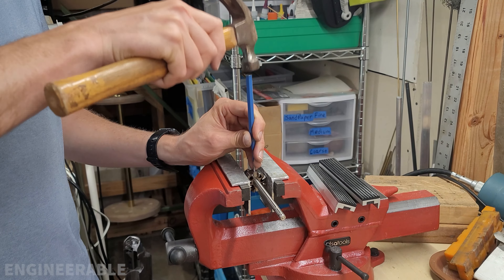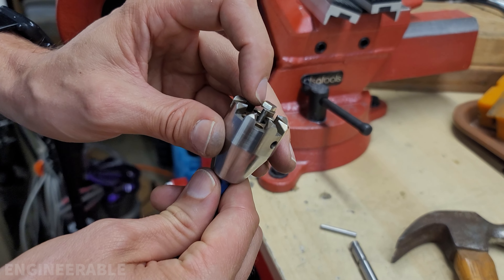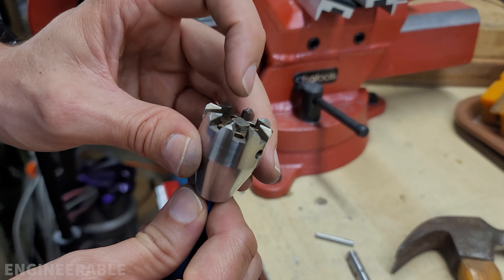I'm going to see if I have any magnets that can work in here, because I don't think I can get all these little magnetic bits back in the shape of a single magnet. Here's the magnet I replaced it with — I found one that was square but close enough to the original and fit inside. I had to grind the edges of the magnet down a little bit so it would fit inside the round area. Here you can see the magnet with the washer spacer.